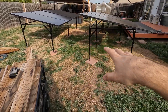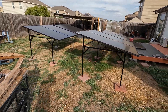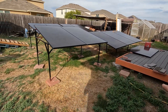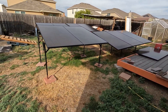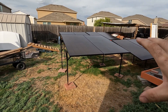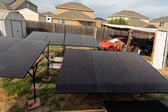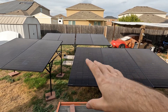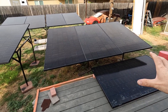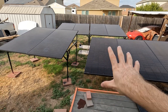I do like having two panels on each stand because I can individually adjust where they're at. You can see what I was talking about with the pavers. I do got to tidy up the wire a little bit, but I am super happy with this — it's a lot better than having them just laying in the yard, which I had for months. We have nice sturdy stands mounted nicely. I'm getting right around three kilowatts of output at full sun. I probably need to clean all the panels. I'll leave this here until I get more material — in the next couple of weeks we'll build two more stands and be completely done.